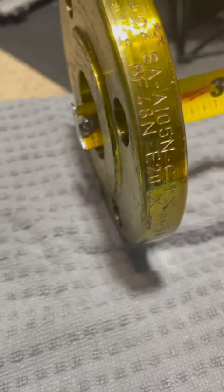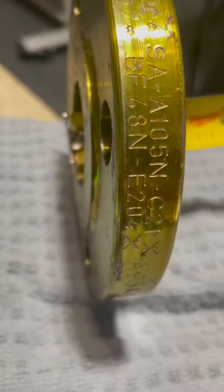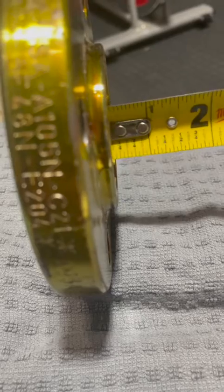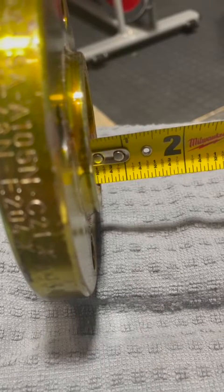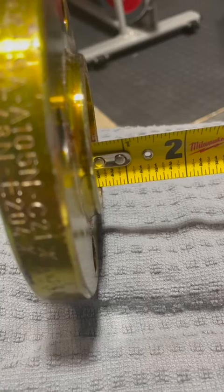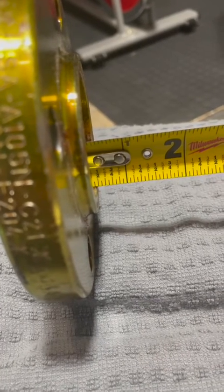Just again, the overview — the review on it. You want to measure the face, basically the whole thing, face to the end. So that's one inch, minus what goes in — five eighths — plus one eighth, and that's your takeoff.